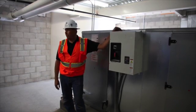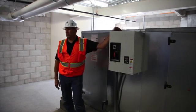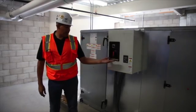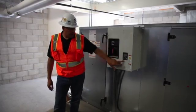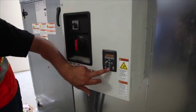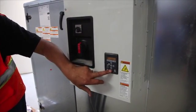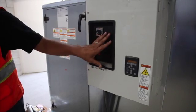Drives are tried and true. They're getting to the point where they almost call them throwaways because they work so well, and eventually over time they fail just based on use. But they're really dependable. In an event where the inverter stopped working, you could physically turn the drive off. You have auto, off/reset, tripped, and hand-on modes. You could turn it off and then put it in full bypass if the inverter failed.